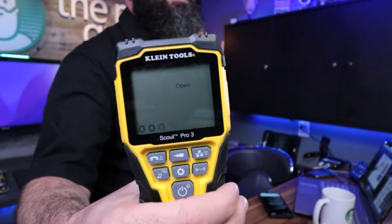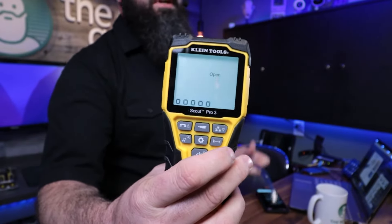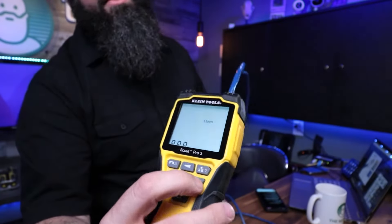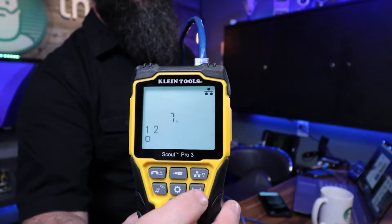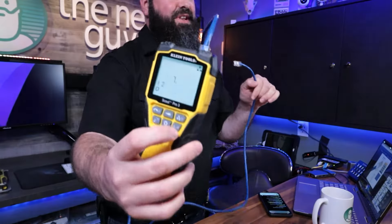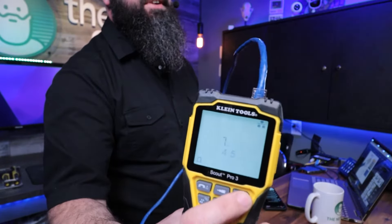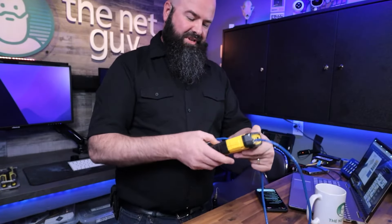This is the screen and it's showing that it's open right now. I'm going to turn the backlight on so you guys can see it — it says open. Now I'm going to plug in that cable that we just made. I hit that button and it's saying seven. Remember I said this was about a six and a half foot cable — it can measure the amount of cable that you actually have. You can use different pairs on it for that distance measuring capability.